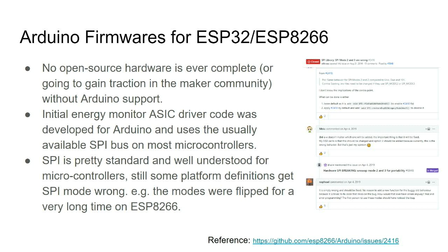Anyway, because of the lack of standardization of SPI and the mismatch between different implementations, it can be quite difficult. Even though you're not doing maths and multiplying, if you have written an SPI driver for a particular chip which does it all, you still have a bit of workload left to make it talk to the host processor.